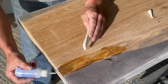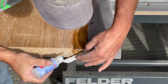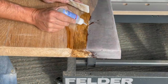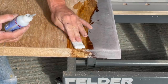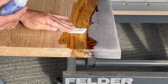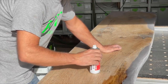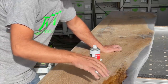Where I think the sapwood is, even on the end grain there's a little bit here. Just rub it on — even on the end grain, just drip it on and rub it on. It's really easy to sand off, it's very very thin, it doesn't actually create any kind of lip and it really soaks in. What I do is I don't put any accelerator on this for about five minutes — I'll go and sand the other piece and really let it drip in, really seep into the grain. Then I'll just spray it with the activator just before I sand it. It'll be an instant fix, it'll go really deep — it's almost as good as a penetrating resin, if not as good, on small areas for sure.